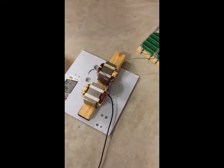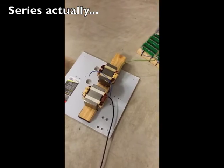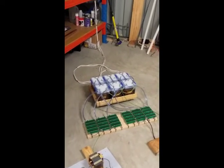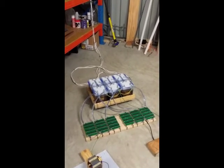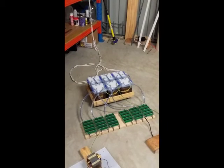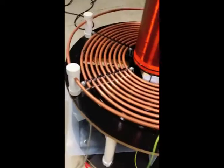Makeshift charging inductor — there's two MOT cores in parallel, about 12 Henrys all up, I think. And then coming over to the gap — they are currently being run in parallel, so we're only getting about 5,000 volts out, 5,500 maybe, and then 11,000 due to the charging reactor. The problem that causes is that 5,000 volts is actually pretty small and I'm running a very tight gap here. Only running the one gap, not running the other side — that's shorted.